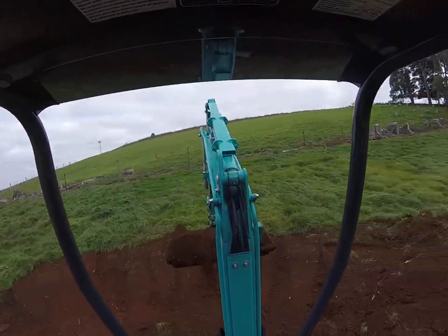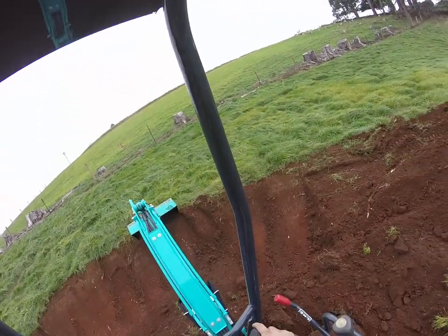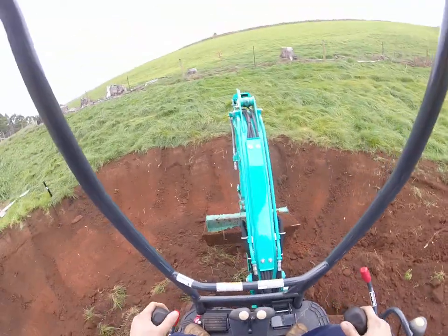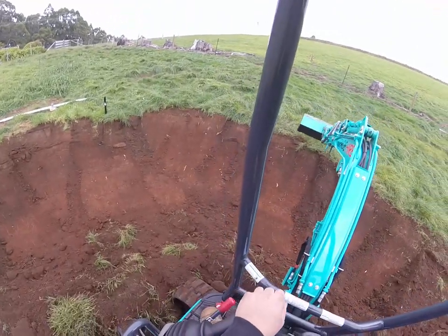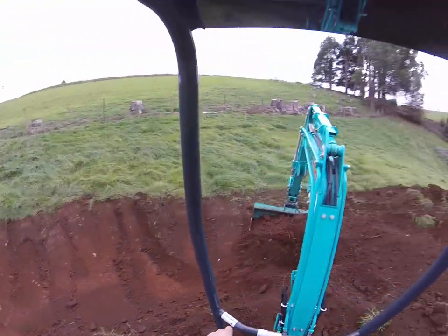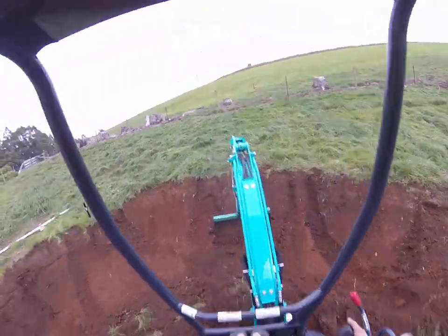We are literally digging with the mud cleaner bucket. See how I've taken little slots out — look at how well that cuts. It's a new machine, 145 hours on the clock. The smart thing is to use half the bucket or less than half the bucket to cut, and you can just keep cutting.